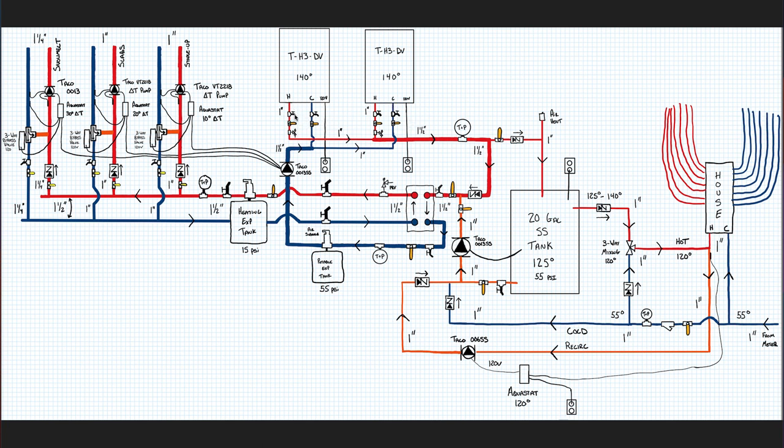Coming out on all four ports, I went into three-quarter-inch hose shutoff bibs and then into ball valves. After that, still in one inch on each unit, there are pressure-temperature and pressure relief valves on the hot output of both units. Then after picking up the second unit through a one-by-one-by-one-and-a-half-inch tee, the primary loop steps up to inch-and-a-half. The hot goes out to the right, cold comes in from the left — this is reverse return piping, which ensures equal flow through both units.